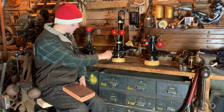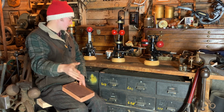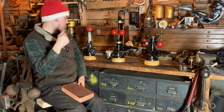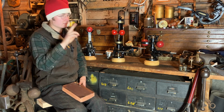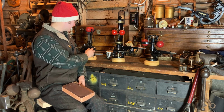The Pickering has it as well. The origin is that the Sawyer or someone operating the piece of equipment could have a direct connection to this governor and could pull a wire or a rope, and that would shut the governor, would shut the inlet of steam to the engine right away and do so remotely. So I'm attached to this.